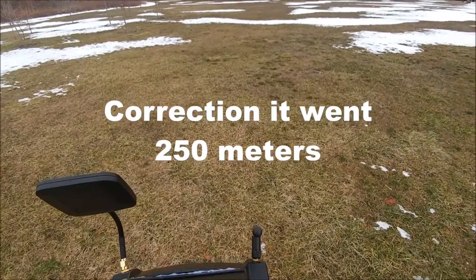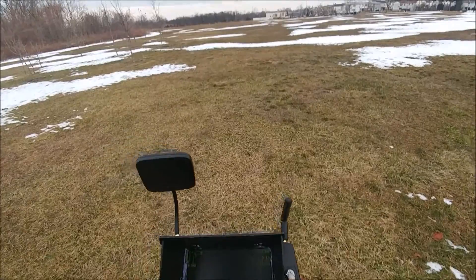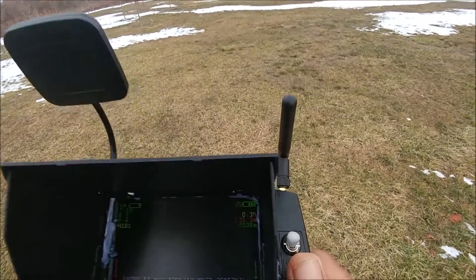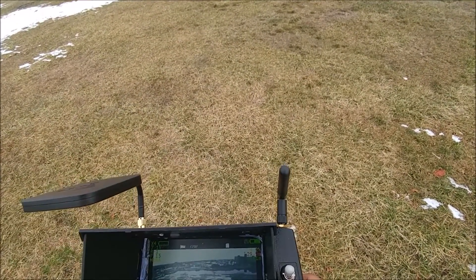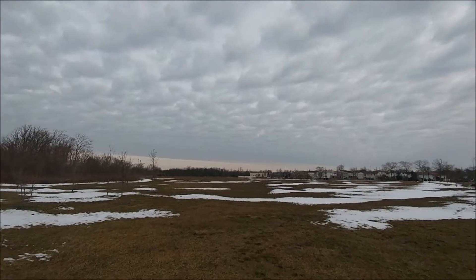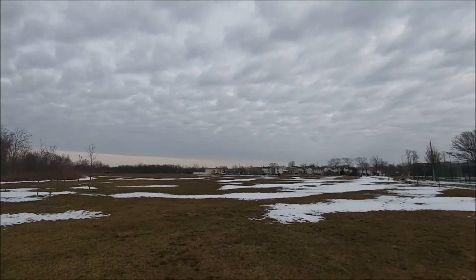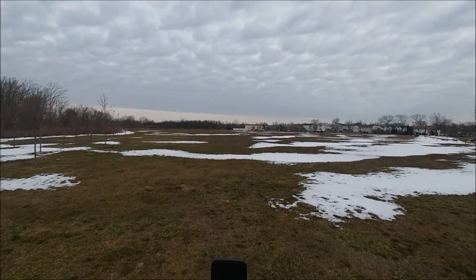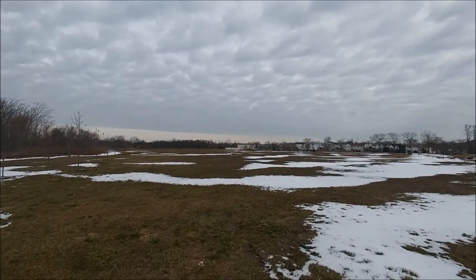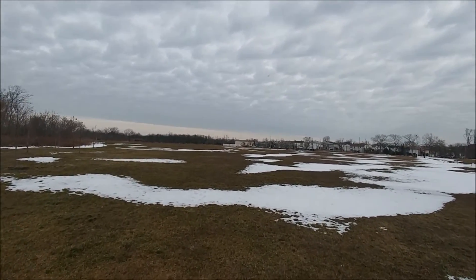I'm at 130 meters on the way back. I mentioned once before that the best quality of this H502S is when she returns to home — I lost FPV for a minute — when she returns to home, I just had to point the antenna higher because it's almost over me. It faces you. Let's hope they fix that issue on other models. I see her right there. Let me take her out of return to home and bring her down. So guys, this is the winner right here — this patch antenna. I'll put links to this antenna and the other one. Do your test yourself, but I'm telling you right now, this one is obviously better.